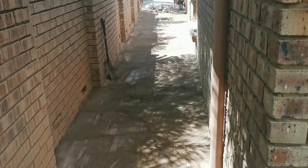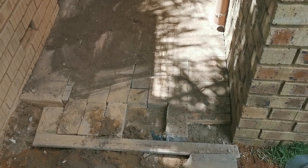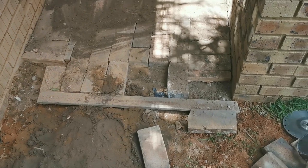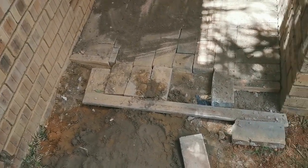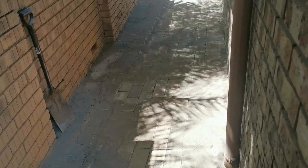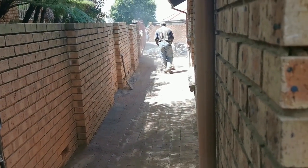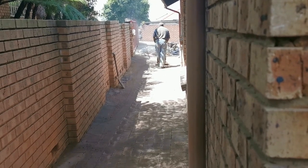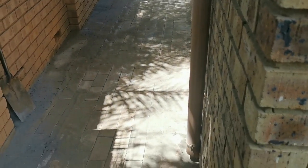Everything has been swept with sand now and the sand is in between the gaps. All that's left now is to compact it once more and to put some cement on these last ones to keep them in place. Andres is now using the compactor to impact the bricks again just to make them fit more tightly and more secure, and while he's compacting, you can see the sand on top is going into the grooves of the bricks as well.